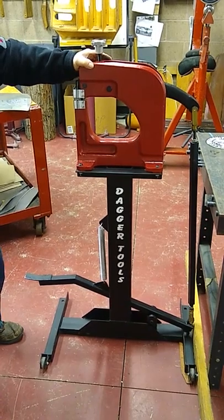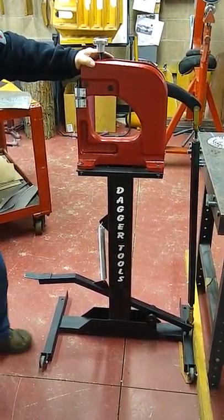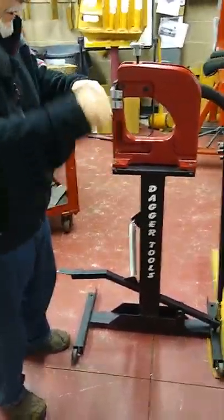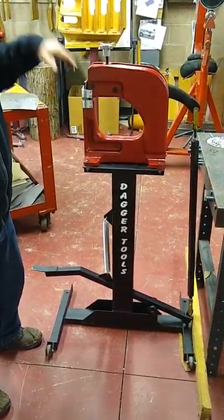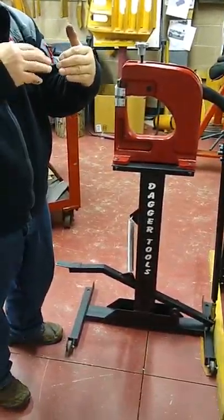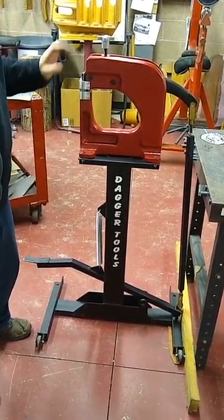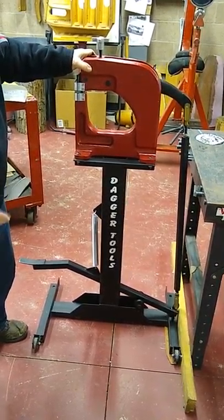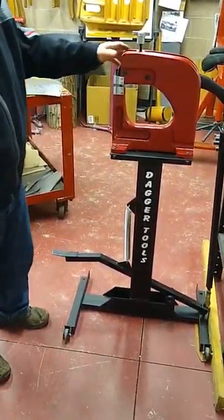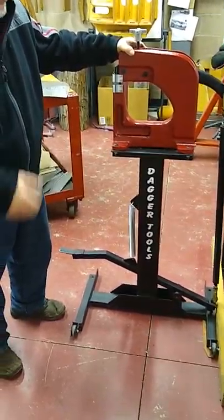Dagger has been making a shrinker for over 15 years. The SH02 is what we currently produce. We also make a bench machine that is hand-lever activated — it uses a two-piece lever design. With the foot-activated machine we get a higher mechanical advantage and can produce more force, and of course your hands are free so you can manage a much bigger panel. You do lose a little force transmissibility with a two-piece lever, so while you can still get 16 gauge out of the bench machine, you'll work significantly harder.